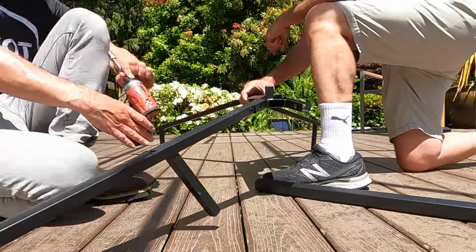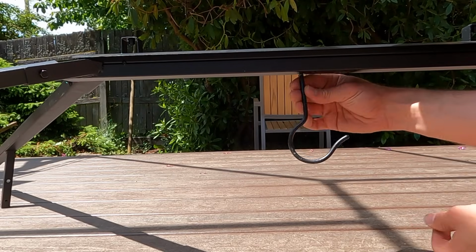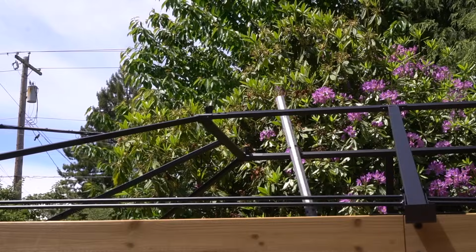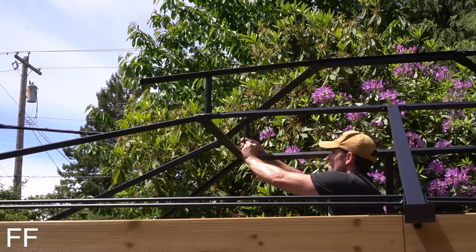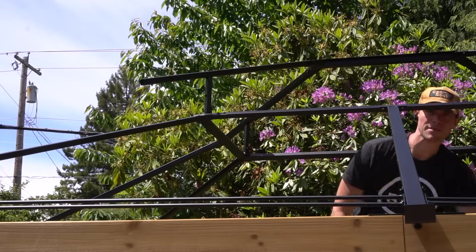This Sunjoy unit that we're installing has a 2-tiered roof system which provides some natural lighting as well as some general airflow, which is why we also have to install a top cap with coat hook. It's a hook specifically for a chandelier or even a heater that you can hang up at the very top. We insert our upper frame system into our lower frame system and secure them together with the same fasteners we've been using for the entire roofline.